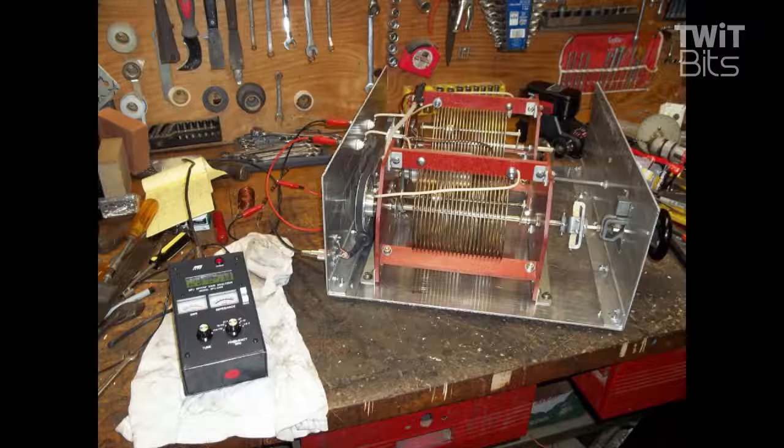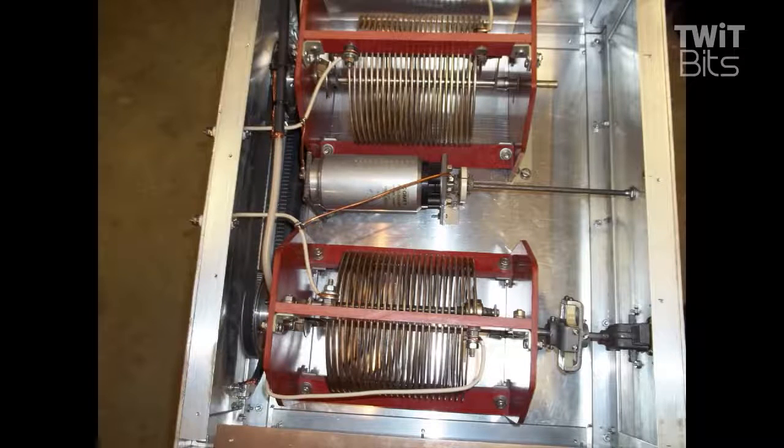It's very unique. Let's take a look at the next picture — this will give you some idea of how this thing is built. It's actually two tuners; most people would only have one. That cylinder in the middle is not a vacuum variable — it's a gas air variable, just like an air variable capacitor but with SF6 gas around it, which is one of the world's best insulators. I worked at a power plant and we used SF6 when breaking 168,000-volt lines with maybe no more than a half-inch gap. Sulfur hexafluoride is what the gas is, Bob.